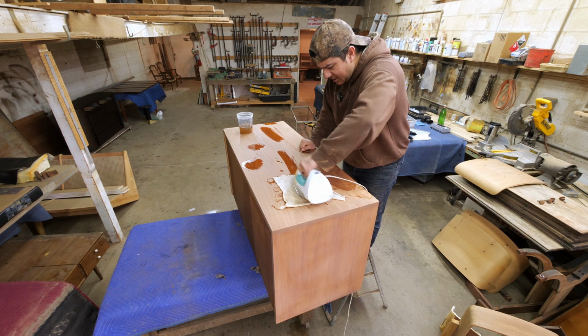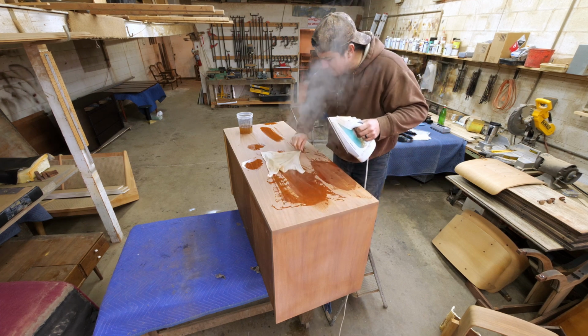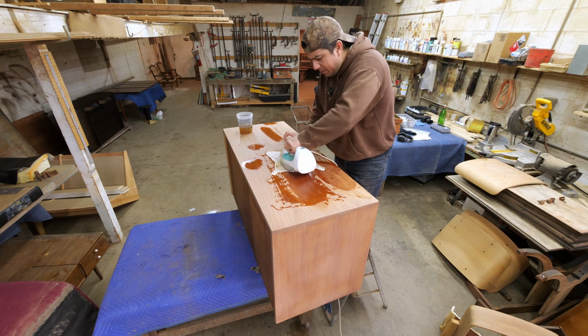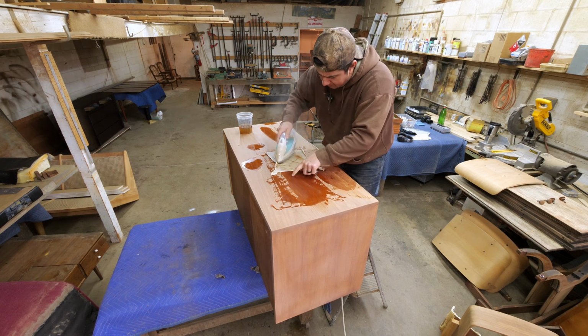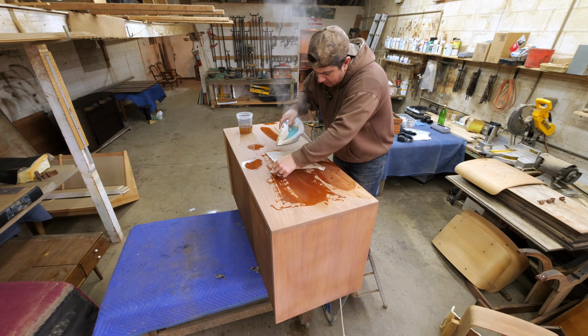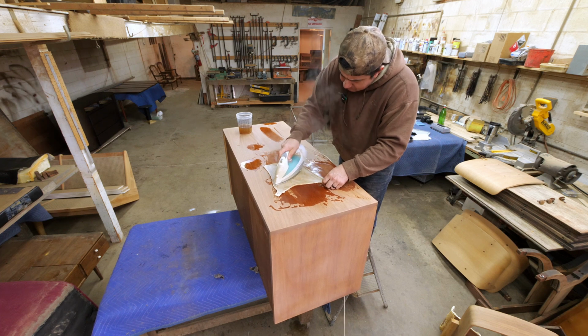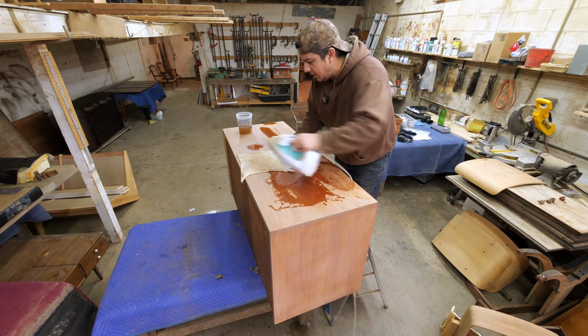The center one was not that bad. Like I said, one or two passes of the steam will lift that right out. We'll let it dry, and then we'll come back with the 150 grit again and get it all sanded down. So there's another little scratch mark that I just saw. Some of these you can't tell until it's actually wet, you won't see any of the dents.